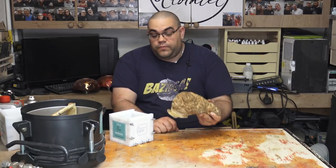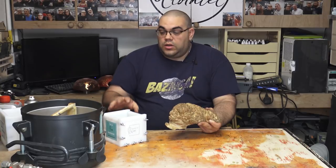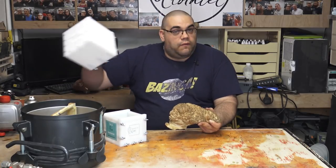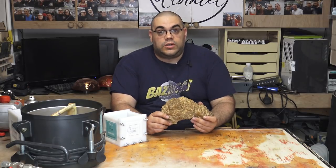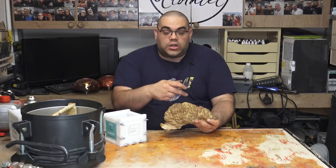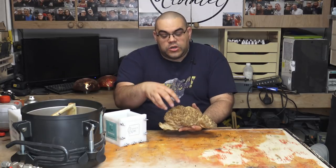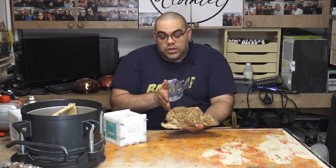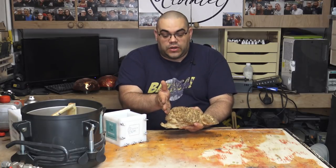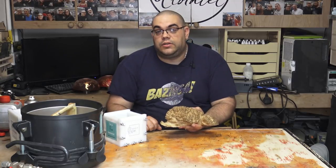First of all, I'm going to cut a piece of this up to fit inside my four-inch mold. Once that's done, we can transfer it to my five-inch mold where I can cast it in silicone. I'm going to take this over to the bandsaw and cut out a 100mm cube — 100mm is four inches. I'm going to concentrate on keeping this bit here because it's the biggest bit and has the most detail. I'll cut flat on one side, measure it 100mm one way, then cut off the other two bits to make the square.